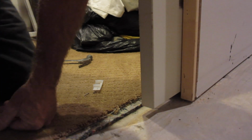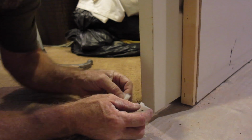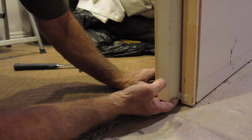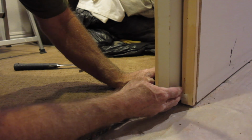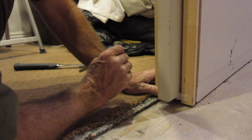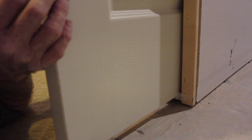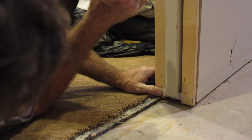Okay. All right, so you have this little guide that comes in with the kit. Again, it goes right under the door. And this is what I was mentioning earlier also about if this wall's a little out of plumb this way, who cares? We can adjust it. The bottom line is, like I said, it cannot rub on the whole body of it. Of course, at the bottom, it's going to be rubbing against the guide.